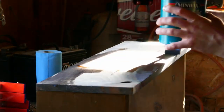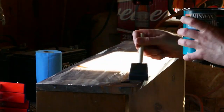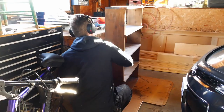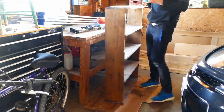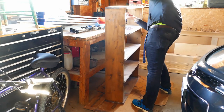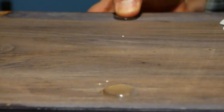The next day the glue was dry. To protect the finish I added two coats of Minwax Polycrylic — this is currently my go-to finish. You just need to make sure the stain is completely dry before applying. I applied one coat, and after two hours it was ready to sand and receive a second coat. I hand-sanded it with 220 grit, wiped off all the dust, and added the second coat, leaving it to dry for 24 hours. I also purchased three-quarter round self-adhesive pads from Home Depot — eight for about two dollars. Since I wasn't sure how the adhesive would hold up over time, I added a small dab of super glue. And with that, the shelf is done.